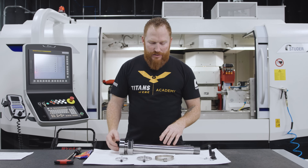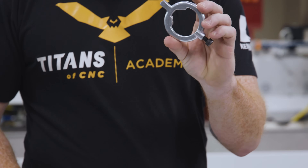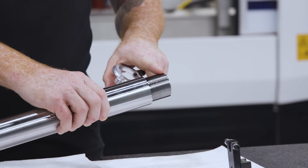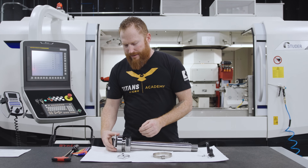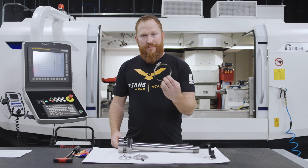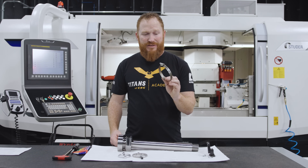It's important that it doesn't slip, so we're going to use a drive dog. You can see how small this one is — I could use it on this side, but I don't want to clamp on the threads and ruin them. I'm going to step up to the bigger drive dog, but that still doesn't have the right diameter and won't fit. What's common practice in the industry is to use a pipe clamp, though I have kind of a weird history with pipe clamps.